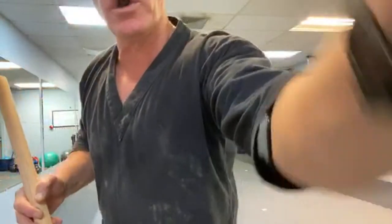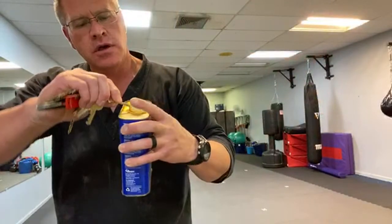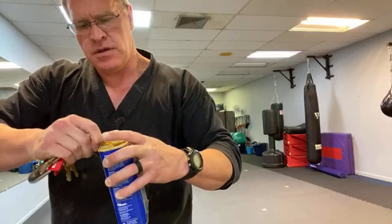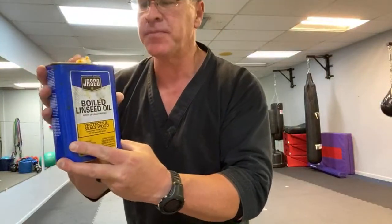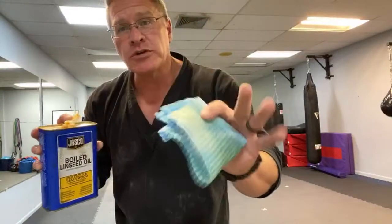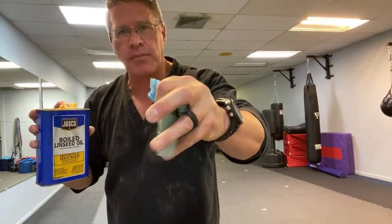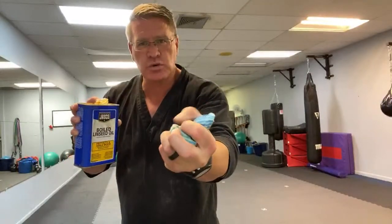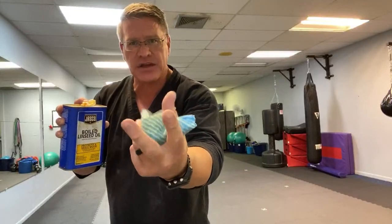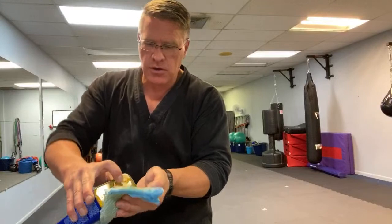Once you knock that off, you're going to use an oil like this - this is boiled linseed oil. I go back and forth between this and a Minwax that has a little bit of wax in it, a little bit nicer oil. This whole bottle cost like $2.99 and it'll last you years and years. When you store your rags, lay them out flat - ideally outside on a rock - and let them dry out. You don't ever want a crumpled-up rag with oil sitting in the basement or garage anywhere near a flame, because the gases will come off and that could ignite.